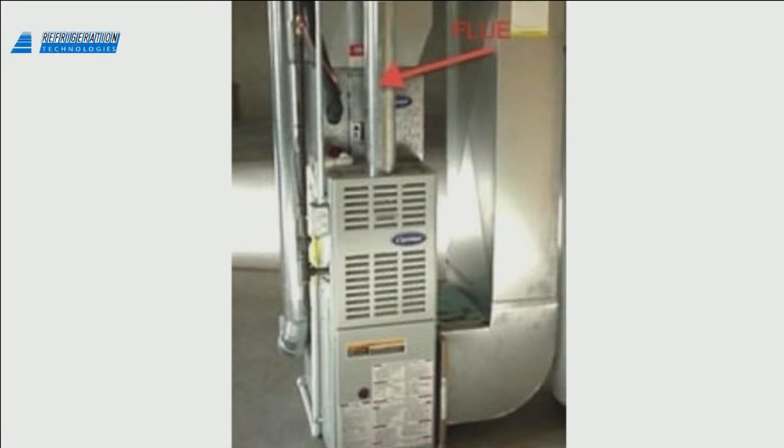Yeah. Yep. Pay attention to that open filter rack, too. If you guys see that, that is enough that on a natural draft water heater, it can cause it to spill. So sometimes we put duct leaks in really bad spots, like right next to the fan. But here on the live stream, we call this a two-for-one moment. Show you where to test the flue and show you why your water heater's spilling simultaneously. Yep. I could go into why that's a horrible elbow fitting too, but I won't. Save it for the duct podcast.